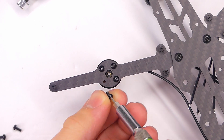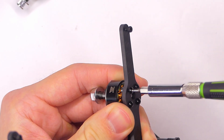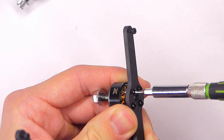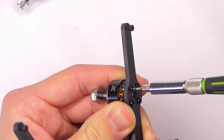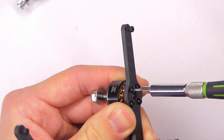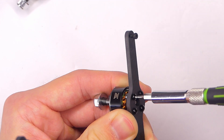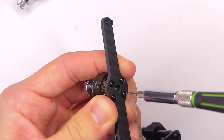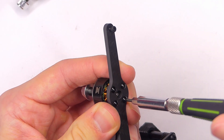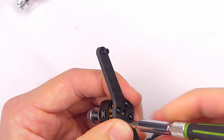Just a little tip for when you're putting in screws — really any kind of screws — to make sure that you're not cross-threading: you can rotate the screw in the opposite direction, like to back it out, until you kind of hear it fall into place or hear it click. Right there, it just kind of fell into place. I could feel it and I could kind of hear it. And then you can thread it in and be sure that it's not going to be cross-threading and get the threads all messed up.